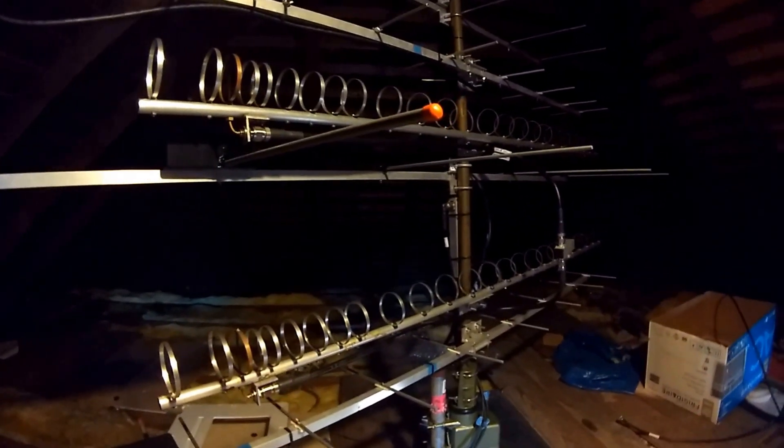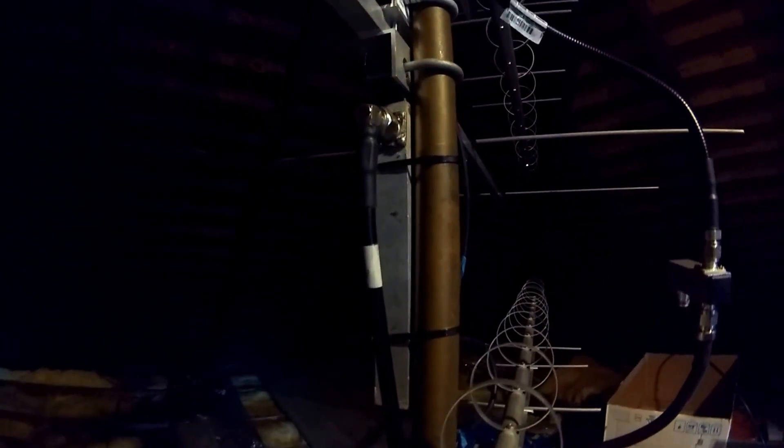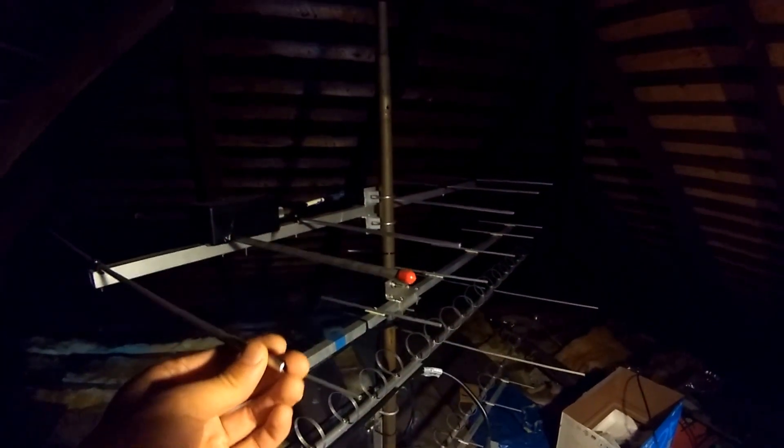I know the stacking distance is not ideal, but it is what it is. I do whatever I can to get on the air. Right here is a power splitter I made — basically just aluminum tubing and a copper tube inside, square tubing. This one is a 1296 Loop Yagi I built — one of two, there's another one here. And this is the power splitter I made — it's actually working pretty well. On top is the 222 antenna, designed and made, it's a 6 element on a shorter boom. All these antennas except the 222 have a boom length of 6 feet.